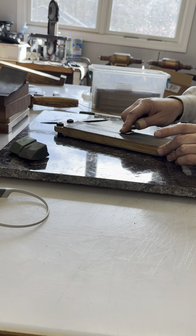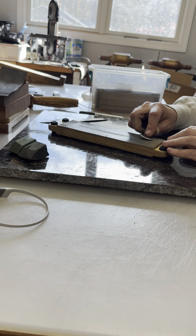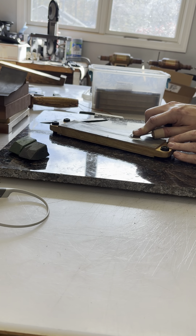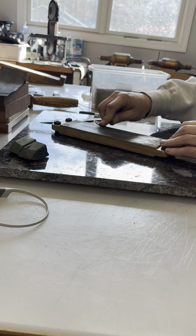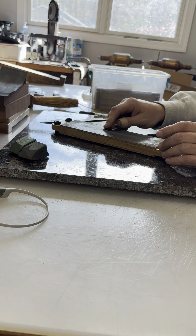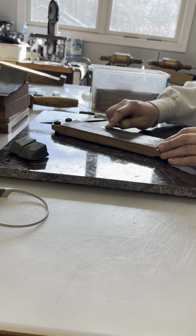Please don't think that how I'm doing this is the only way — there's a million different ways. Practice and experiment with what way your hand works best. I see some people do the whole edge at once — I'm just not very good at that. I do about half at a time and I sort of blend those in. Also, I found this compound from Bark River — I really like it. This coarse one, I can feel whatever grit they use, pumice or whatever. I'm not into the science of it that much, but it's truly sharp-feeling and you can feel the difference. Also, if you've gotten some scratches in here, lay that blade down and just give her a push back and forth. You don't want to come up — you'll cut your strop and you'll have to replace it. Ask me how I know. Don't look at that spot or that spot — it's where I've made mistakes.